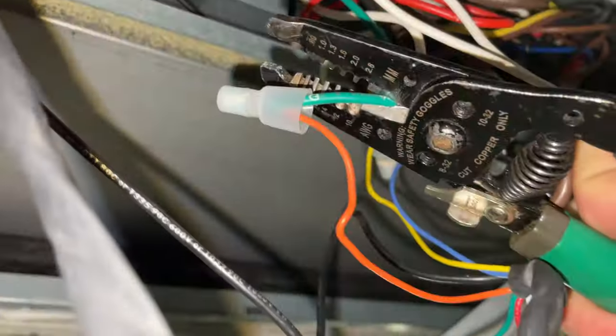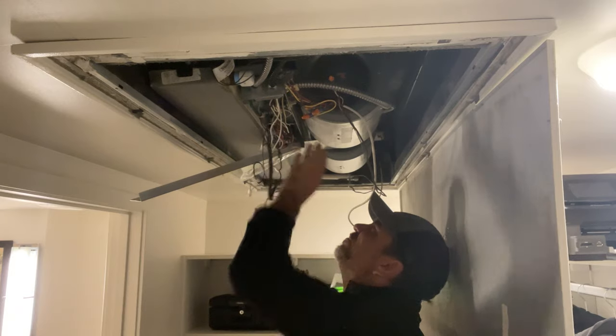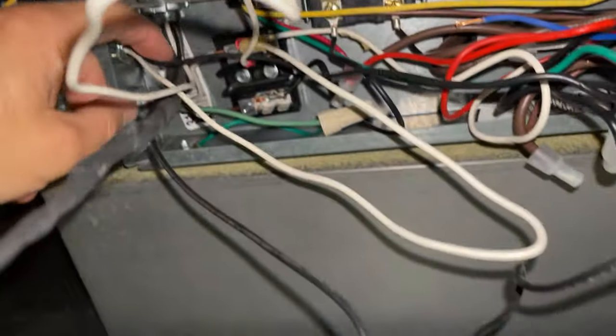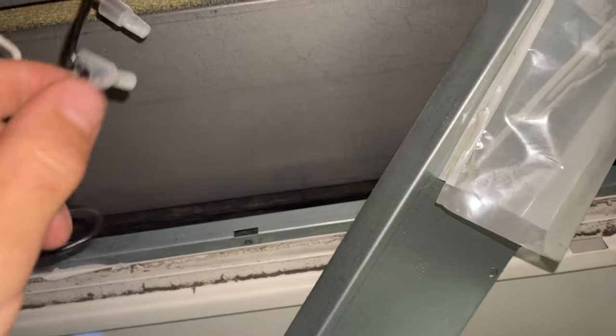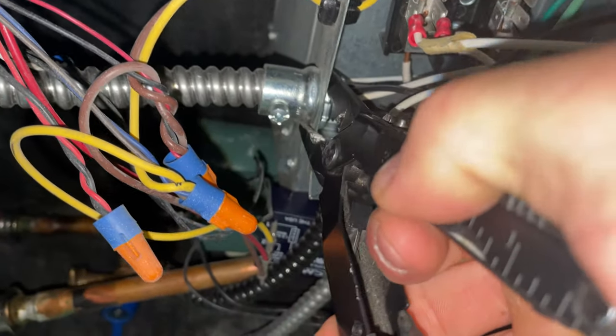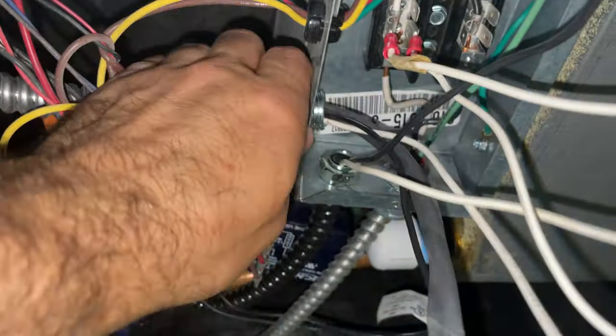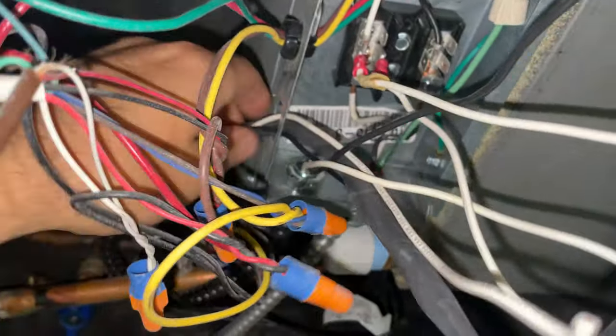Power is off at the disconnect and low voltage is disconnected. I'm going to strip the three communicating low voltage wires back just so I don't have to do it later. Next, I'm going to follow my high voltage wires coming in, cut and strip them, and remove the conduit locking nut from the motor's high voltage entry. Now we can remove all the voltage wires.